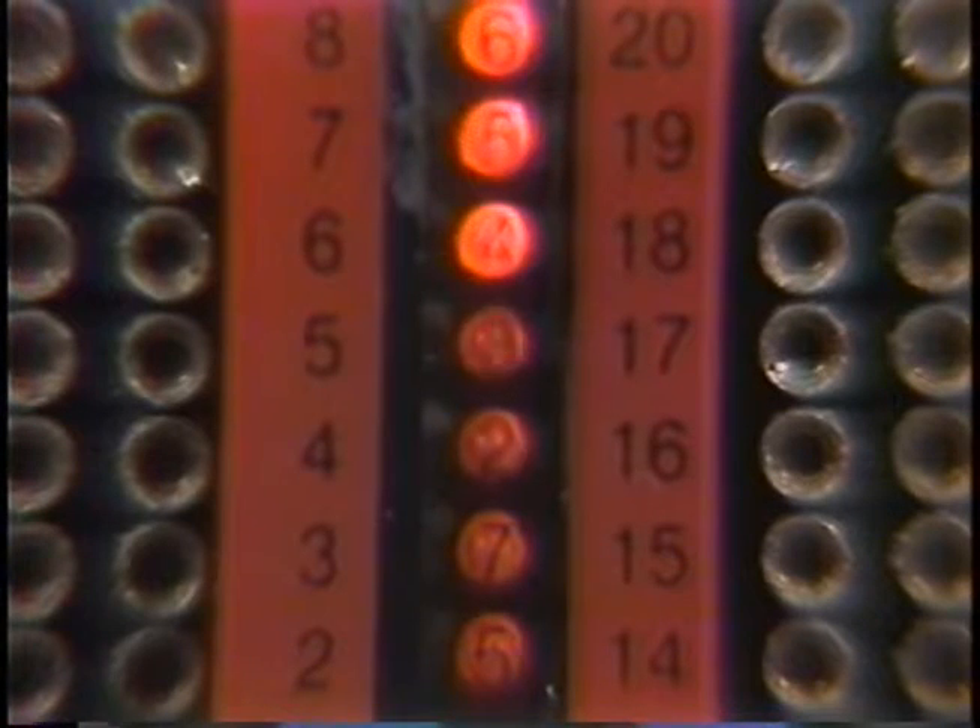See how the send and receive data LEDs flash to indicate data activity. But suppose you use this and discover the cable is wired incorrectly for a new application. The PBOB is designed to provide the added capability of rewiring RS-232C cables.